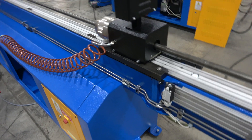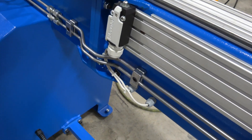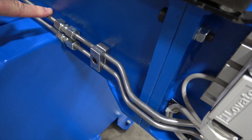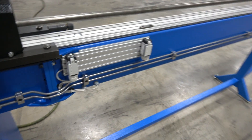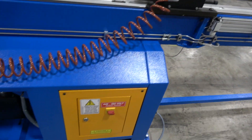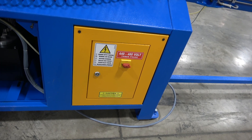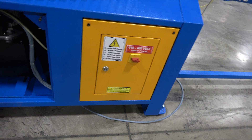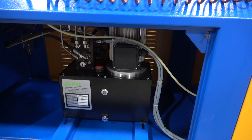This here again is the backside. When you have an extension on the table, you'll have this situation and when it arrives you'll have to go ahead and reattach these two hydraulic lines here — they go to the table extension on the back. There's a main power on switch. We pre-wire that per the customer request — that can be 208 to 480, three phase. And there's a quick glimpse at the hydraulics and the reservoir underneath the table.